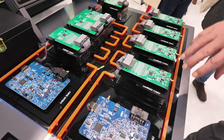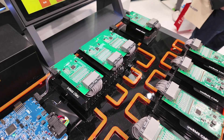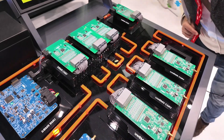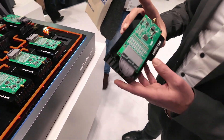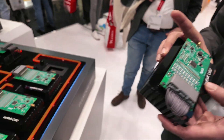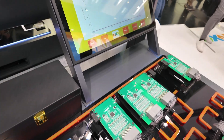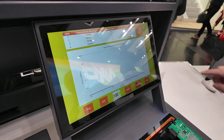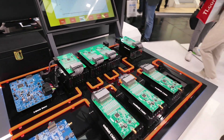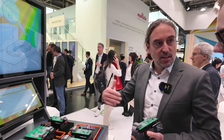Each of these devices is controlling up to 18 cells. You can see here — these are all those wires. And what's specific about this system is that you can take one — as you can see, there's no connection — and you are communicating wirelessly to the main board. This main board is connected to our computer inside, depicting data on the screen. We have CMU 1 to 4 — so we have four of them — and we are always communicating.